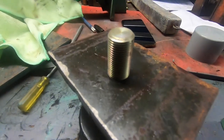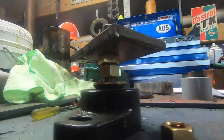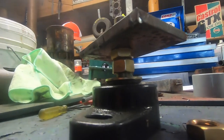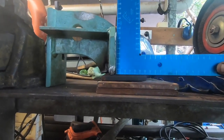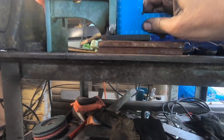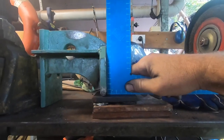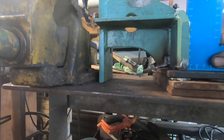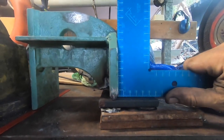Gone for a pretty tight fit around here so none of the wiggle room is going to come from the hole, because I want the nut to take as much of the load. If you've got an oversized hole, not enough of the weight's going to be sitting on that nut. I've got it propped up on this steel here but it looks like it needs to come up just a tiny bit more to be plumb. Just a thin hacksaw blade under the other end - that's got us there. Let's start welding.